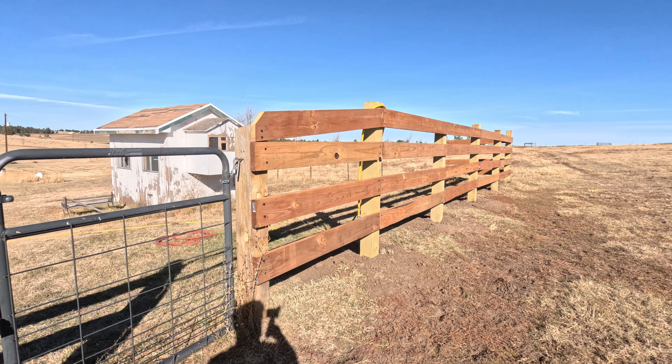I tied the barbed wire fence — this short run of barbed wire fence — into this post and tightened everything up. Because it's such a short run, I use these turnbuckles so that they can be adjusted. There's just not enough stretch in such a short run, that's why I use turnbuckles on really short runs like this.